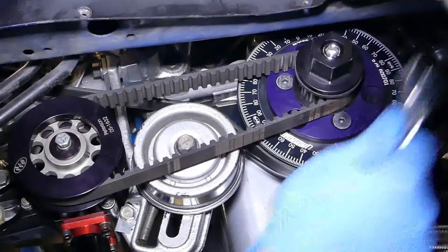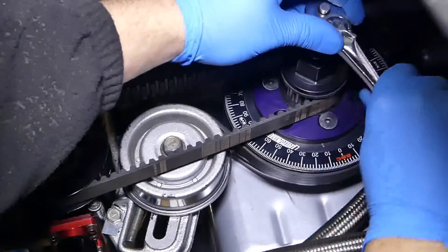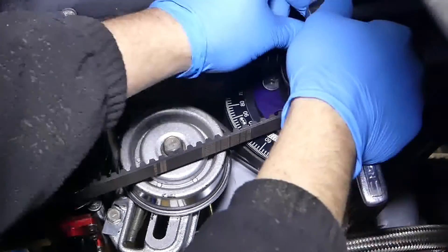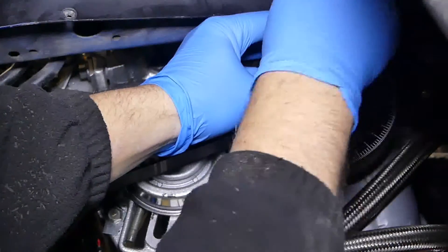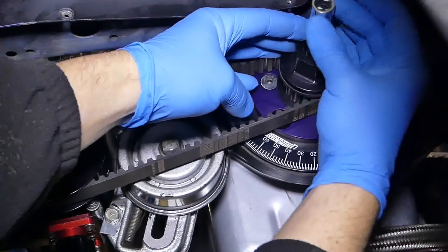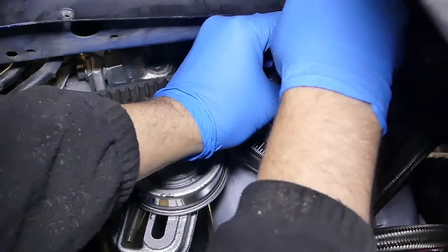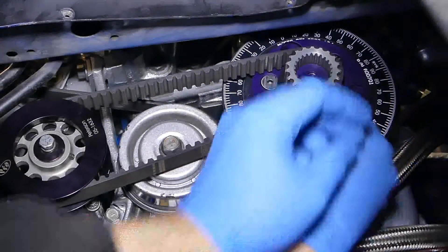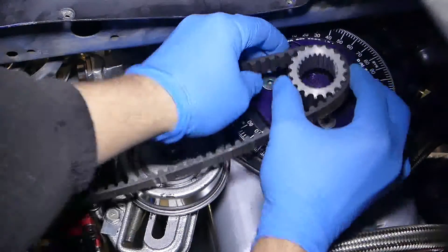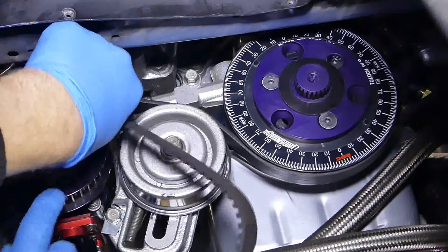The first thing you've got to do is take off this 3/8 drive. First thing we want to do is simply remove the belt — just take that whole thing and slide it off, because we're going to need to access this pump here in a minute.